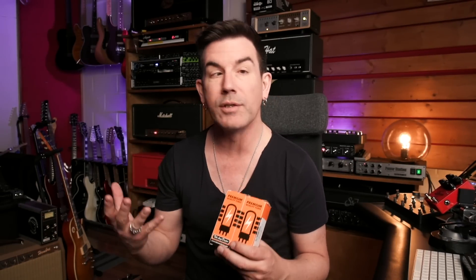The tubes are made by PS Vane, sent to Tube Amp Doctor in Germany, where they match and test them, then send them out. So today I thought let's put them in my 50-watt JMP. I'll have Dave Friedman bias it up and we'll listen to them and actually compare them to what I've got in there now, which is some RFT Siemens EL34s from new old stock. At least today we can take a listen, see what they sound like, make sure they're matched and bias up okay, and that they don't run away as soon as we plug them in. So let's get to it.